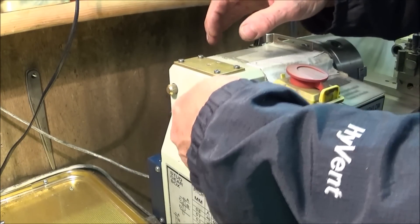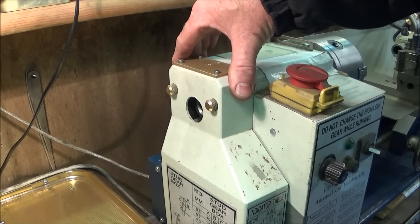To show you how I aligned the pin assembly, I've taken the aluminium block off. If you're making this tool, do all the drilling on the brass plate and the holes for the aluminium block and fix this to the guard before doing the alignment, because you need to take the guard off several times — that's why you need the easy-undo locking bolts. Then screw it up nice and tight and it goes back in its position every time, nice and solid.